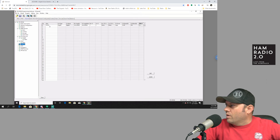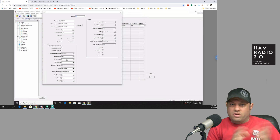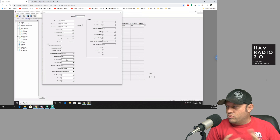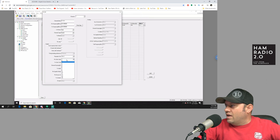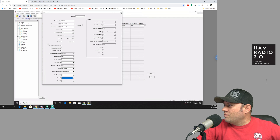Here's one thing that's cool about programming the channel — you do it all across one line and it pops out a window. You can change the color code and the time slot. Interestingly, it has a separate RX and TX color code, which I thought was strange — I hadn't seen that before. Usually the color code is the same on transmit and receive. This one lets you change them independently, so RX could be four while transmit is one. I guess that'd be useful for simplex work where you wanted to hide from people. TX admit is set to color code, and contact is Texas.